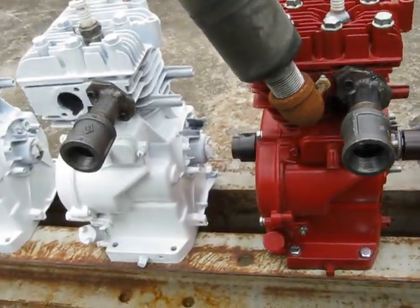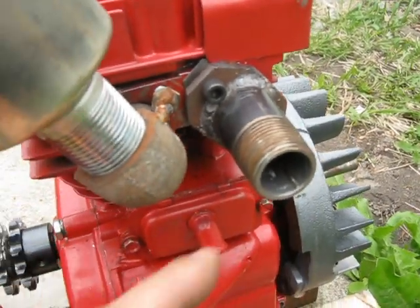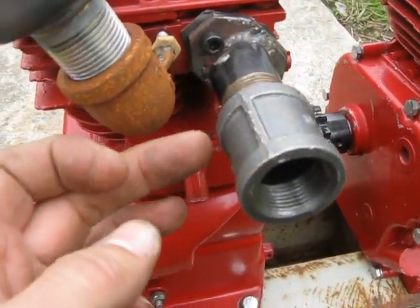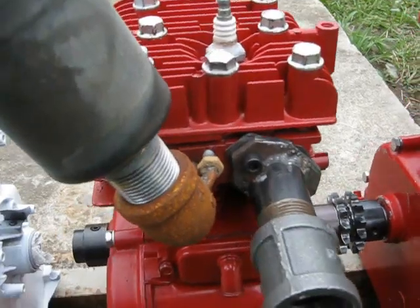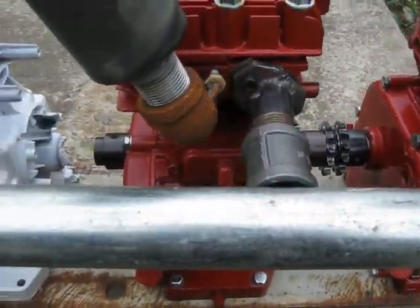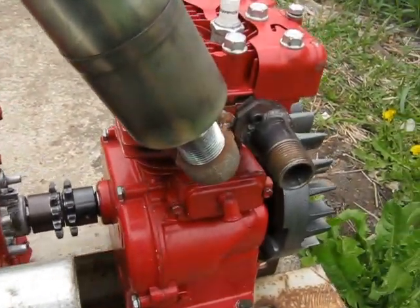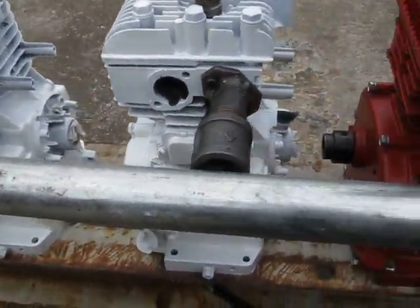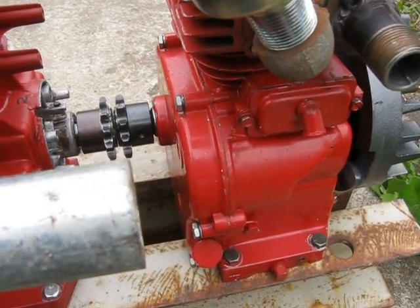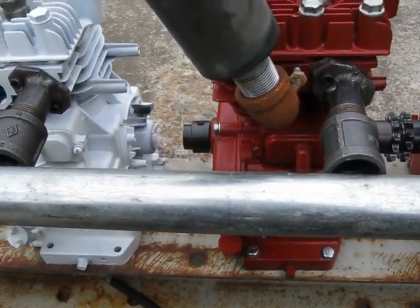The carburetor is probably about half the size it needs to be, but anyway. So I'm going to make flanges up here and have a three-quarter inch pipe. I'll put a pipe coupling on it and cut the coupling in half. Here's my main intake pipe — it'll come across two cylinders and then end. Then I'll come in with a single pipe from this cylinder over and join at the back end. I'm also going to incorporate a piece of rubber hose in that intake pipe on each end.